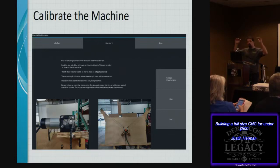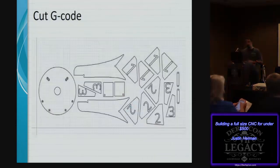So you know one part of the upper portion of the trapezoid. You also need the lower portion of the trapezoid, knowing between the 2 mounting points on the sled. And then, of course, you need to know the center point of the lower edge of the trapezoid to the center bit. So that way, as you move the bit across the platen, you can know the exact location to cut.